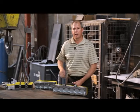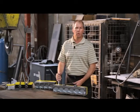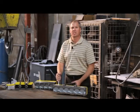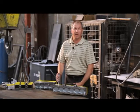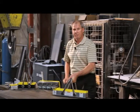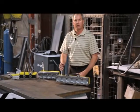This is our largest in the line. It's our MLAY — standing for Manual Linear Array — of 1,000 MagSwitch sets times 6. That's a 6,600 pound lifter with a 2,100 pound rated breakaway, or 960 kilo rated breakaway, in a 58 pound package. Nice and lightweight and very strong.